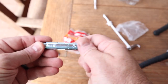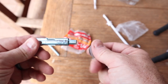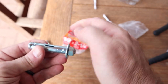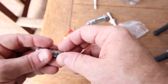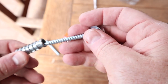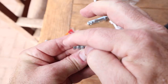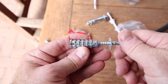The way this works is you drill a hole, you put this in, use a hammer, tap it into the block — which in this case is through the drywall, wood, and block — and then you tighten down this nut, which pulls through and expands the sleeve, wedging it in. Another option is an anchor sleeve: you drill a hole as wide as it is — also half inch — and screw the bolt in, and you can see it expands as you tighten. I decided to go with the sleeve anchor on this one.